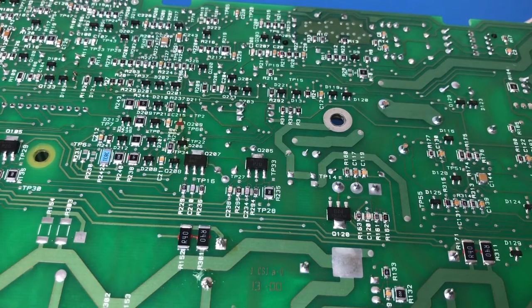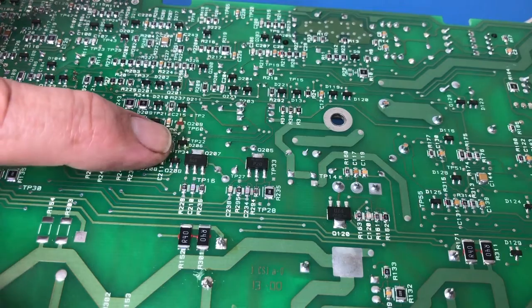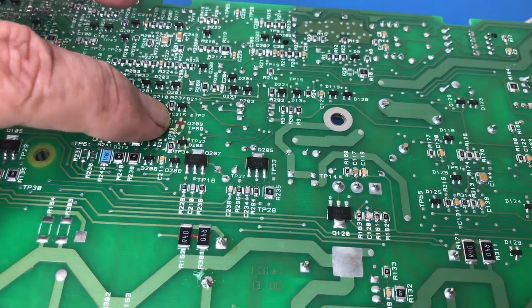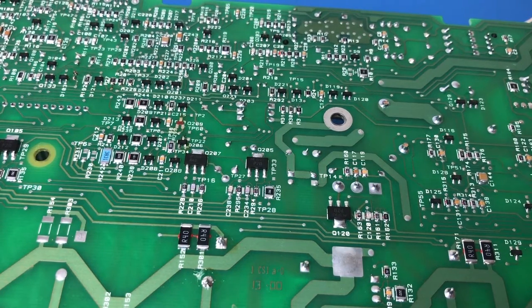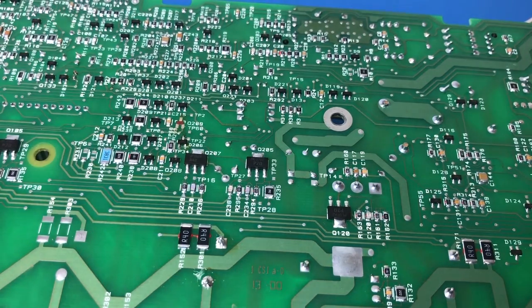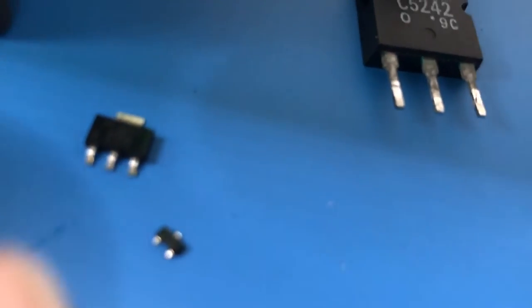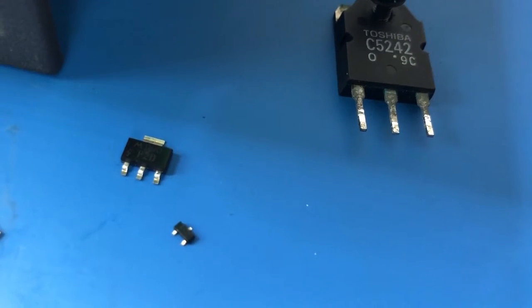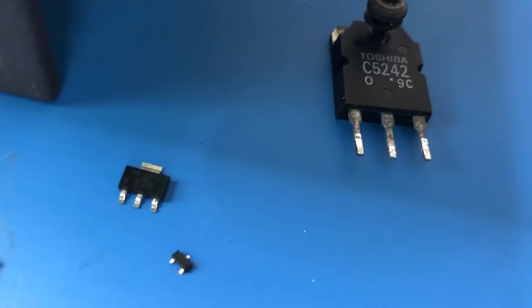Okay, guys, I'm sure that you spotted before I did that I made a bit of a blue and actually pulled the wrong part off. Ended up pulling this one off, which is a diode. And it's actually this part here that needed to come off. So I needed to put some more electrons into the camera. While that was happening, I put this guy back on and I pulled this guy off. And sure enough, as I expected, that transistor has failed. I've got basically no chance of getting that onto the transistor tester, but it just measures as a resistor, so that part has definitely failed. So there are two transistors there that have failed.